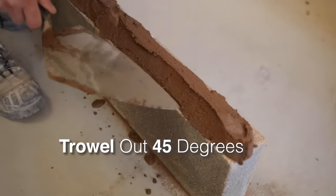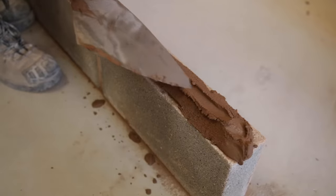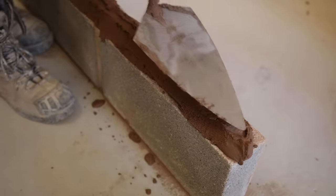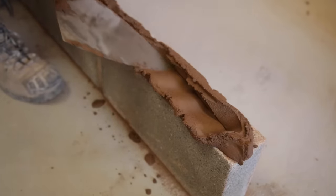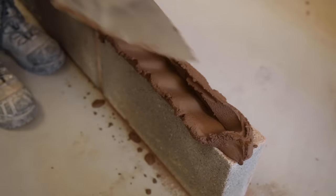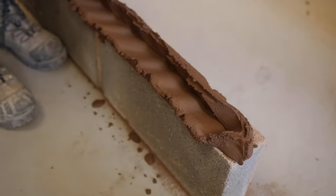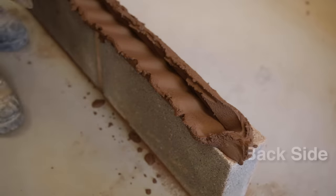It's just a tapping motion, keeping the tip of the trowel on the centre line of that Toblerone shape you made. If you just draw a line down there to help you out, that's where you're tapping. Now you're coming parallel, out 45 degrees, and then tapping — keeping the tip of the trowel going down that line. You can see that's why I angle my trowel out: it just creates like a wave over this side, so the mortar is coming this way, because we don't want any mortar to drop down the back. As long as we can minimise it, we'll keep our cavities clean.